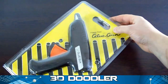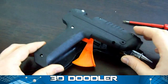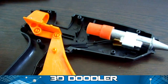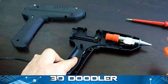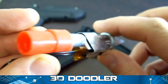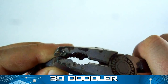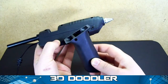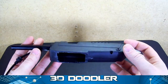I found this 2-dollar cheap glue gun and removed the screws. Inside there is a heater and push handle that we don't need at all. Take the heater element and with pliers squeeze the nozzle to make a smaller nozzle hole. Also, you're gonna need to cut the handle. The hole that we make, we're gonna cover with a plastic piece for better design.